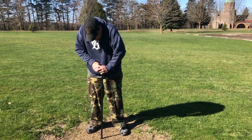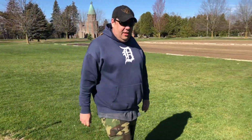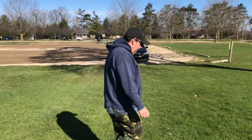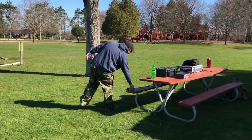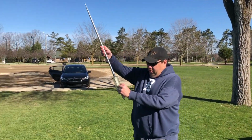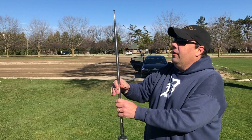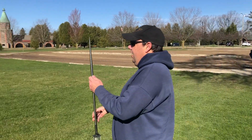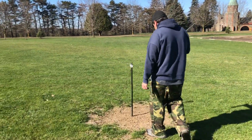This is the, what antenna is this? This is gonna be the MFJ Big Stick. I think it's 1431, the model number or something like that. All right, there you go. 18 foot telescoping vertical. So this is what it looks like. It's got the loading coil, the tap, and it's at 40 meters right now. I marked it there, but basically you just put it in the mount and you telescope it all the way up and run the counterpoise wires out and you're good to go.